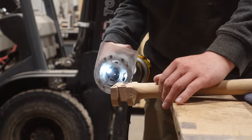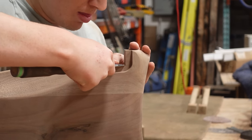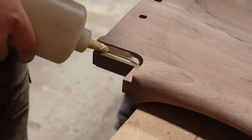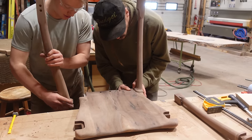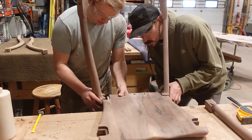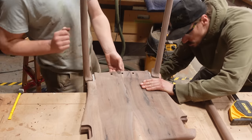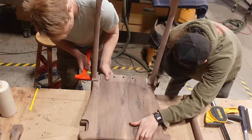You can see the shoulder left by the cutter on our CNC machine — we had a custom cutter made specifically for this joint, and there's a matching groove on the leg that slides right into it. We're using Titebond III as an adhesive to secure the legs in place. On the outside of the joint there are two holes that we're going to secure two wood screws into, and then we plug those up with dowels afterwards.